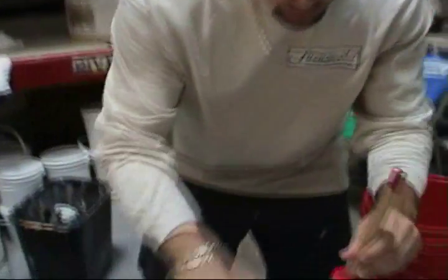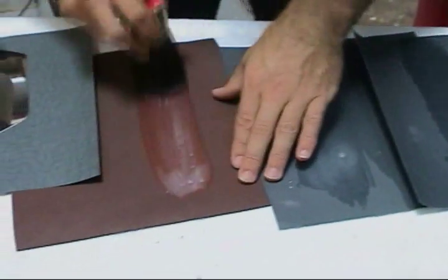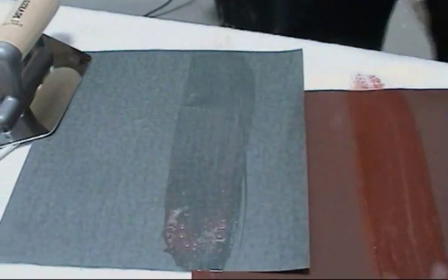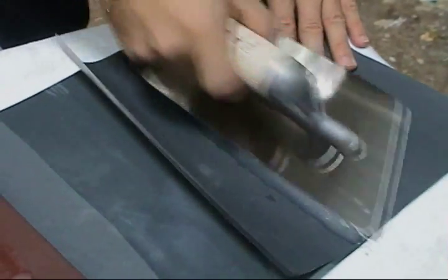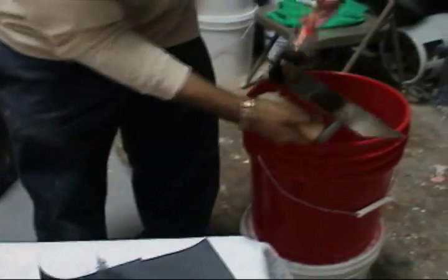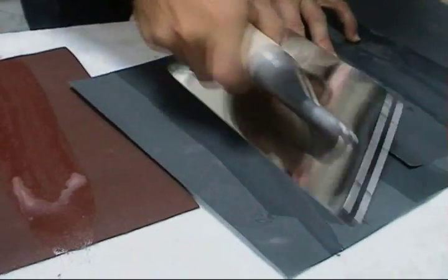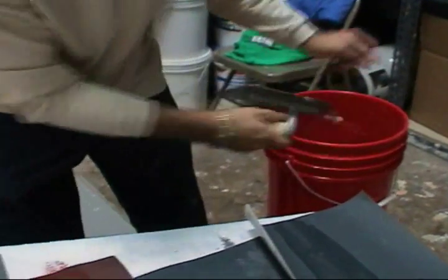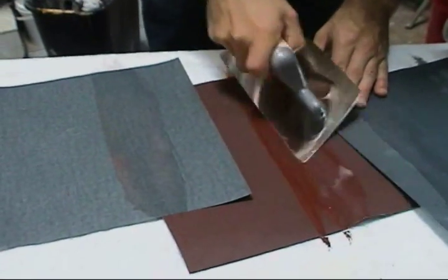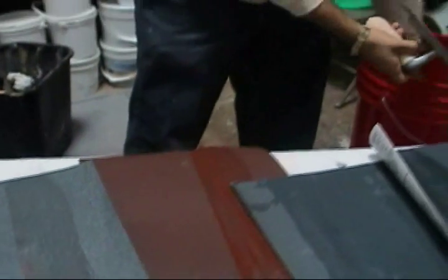You're going to get water and wet the sandpaper. I'm going to get my trowel and start with the 400, and start rubbing it. You clean it, then jump to the 600. Of course, you want to stay a little bit longer on each sandpaper. Clean it again, then jump to the 800. And then you jump to the 1500.